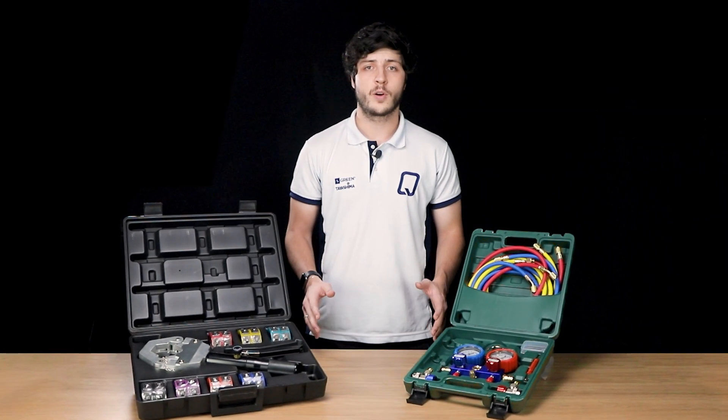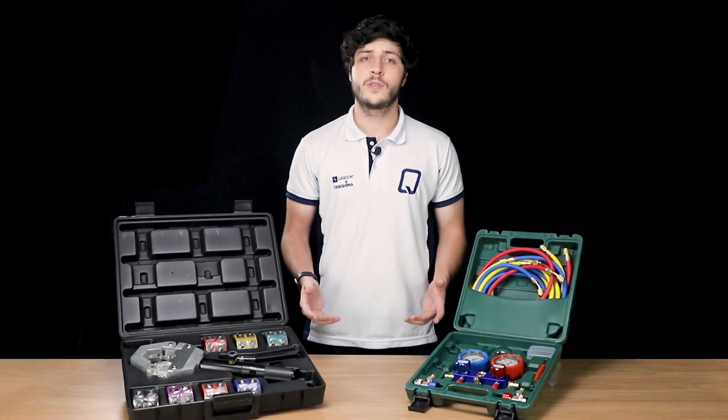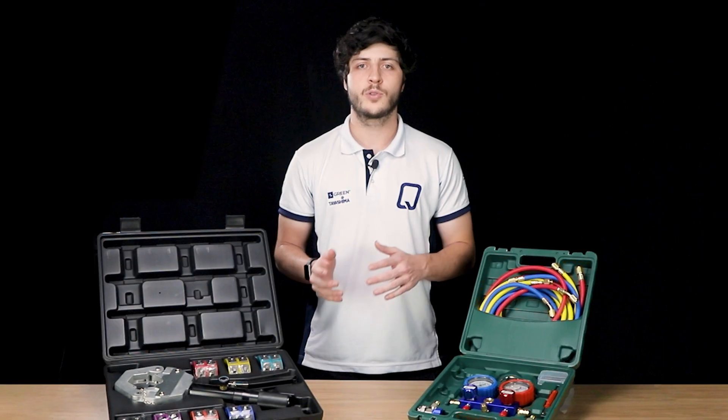In this crimping, the fixing process of the hoses in terminals is done through metallic covers placed in the crimper. The main part of the assembly is located in the forming tools — the jaws, also known as the nuts. The size of the jaw is adjustable according to the size of the hose you need. Some crimpers allow you to open the nut set, making it possible to crimp hoses with larger flanges.